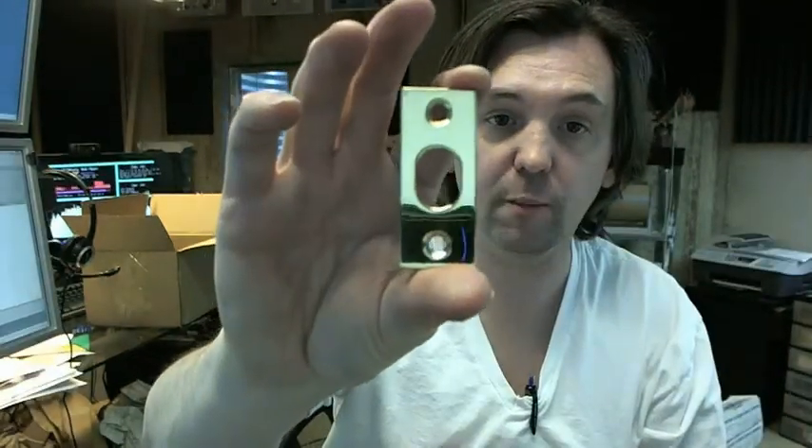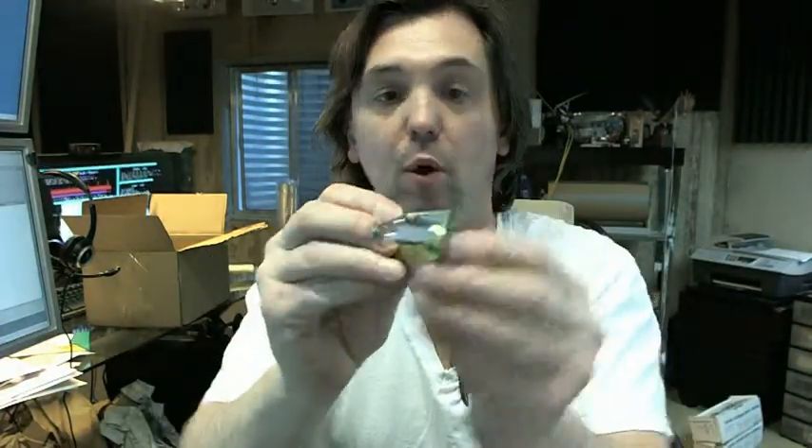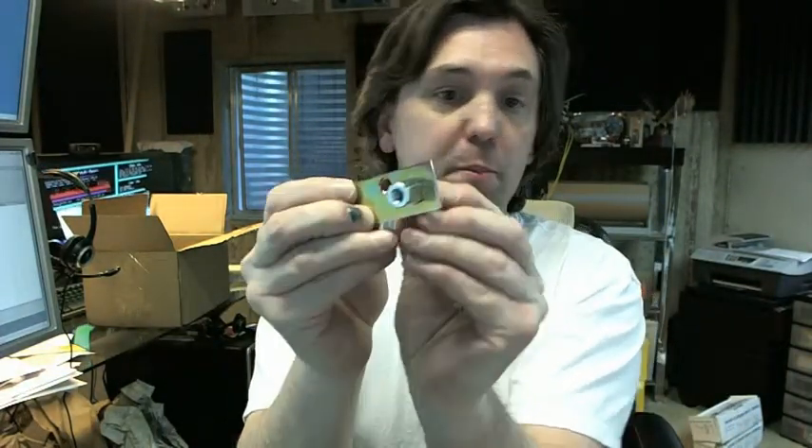Also included will be the finished strike plate for mounting in the floor or the header — same architectural finish. The guide plate is very, very important to install at the top of the door. It has to go through there like that; that will keep the bolt from spinning.